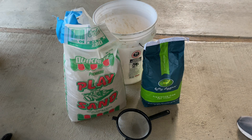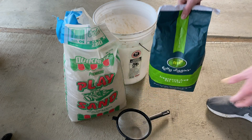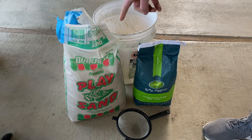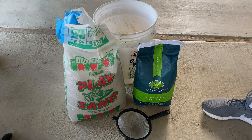In this video I'll be showing you how to make green sand. What you'll need is bentonite clay, which you can get from cat litter, and you also need play sand. The first step is to sift your play sand to get it into a finer mixture.